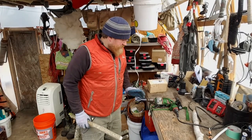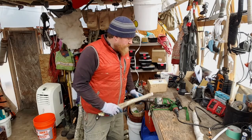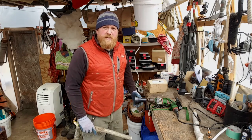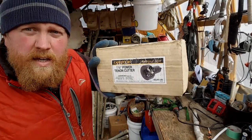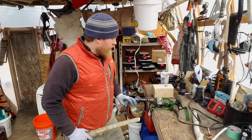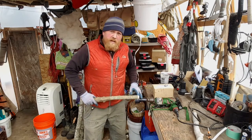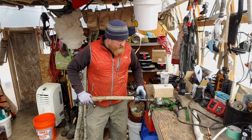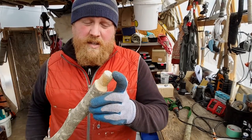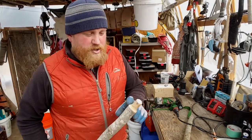So the first thing you want to do once you're at your mortising jig — I strap it to my bench — use a good Milwaukee drill, something solid. You don't want a cheap drill that's going to bust apart on you, because it really takes a toll using this large mortising bit. The one-inch bit is what I have in there. Fire it up. Take a piece you're not using as a test piece to get the right depth — drive it all the way in and then take it back out. Cut off what you need as a spacer block so you don't drive it in too far. I have one I did in the past and I want to do that same length again, so I'll cut the spacer to fit so it bottoms out. If you try to do it to a pencil mark each time, you're just going to get frustrated and overdo it.